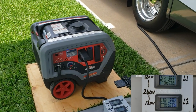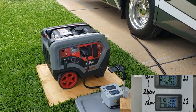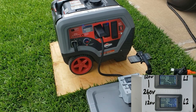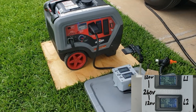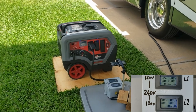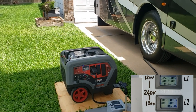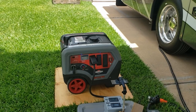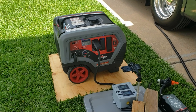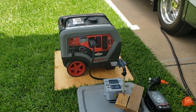I'm not going to test this on my RV. That's a first — I'm not going to be testing this generator further, due to the fact that when it lowers its voltage it goes too low. See right here: 105 to 104 volts on both legs. I know once I put a load on it it might kick back up, but I'm not taking that chance on my RV. Sorry for this quick test — that's a fail. If you like this video, give it a thumbs up. I'm being open and 100% honest with you guys; I'm not going to give this a good rating if it does this. Give me a thumbs up, leave a comment, tell me what you think. Have a great day!